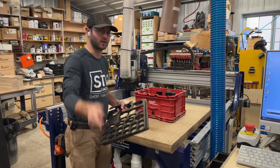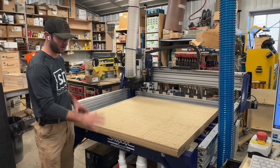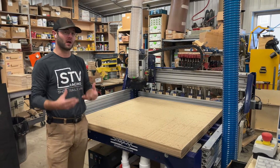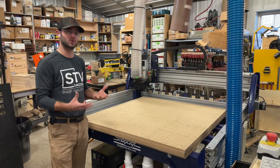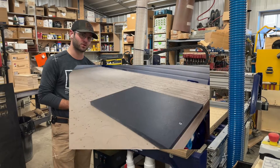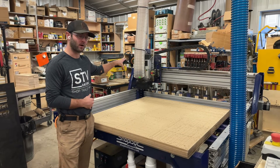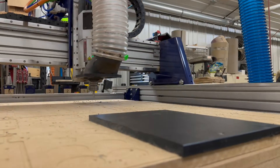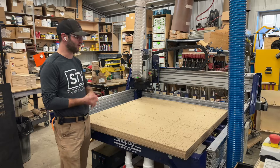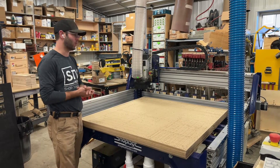So let me clear this off and then we'll take a spin around this CNC. As stated before, we have a 4x4 cutting surface on here. We do have a vacuum table to hold down larger sheet goods and larger products, but a lot of the HDPE products have holes in them so we lose vacuum. So we put a one-inch MDF spoil board on top that allows us to screw down and secure our smaller parts. The 5 horsepower spindle is extremely powerful — we can rip through half inch, three quarter inch, and even one inch HDPE in a single pass, and matched speeds and feeds give us a very high quality cut.